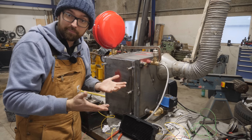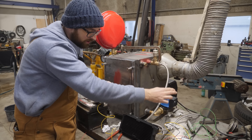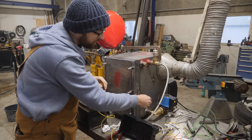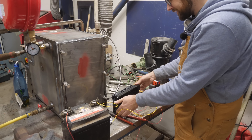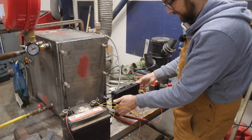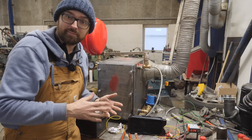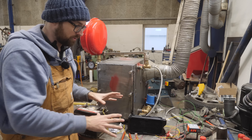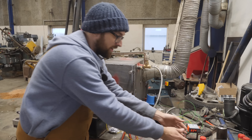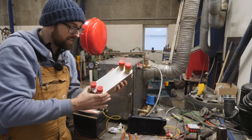The way this system works is pretty simple. There is a circulation pump that pulls hot water from the top of the boiler, where it's warmest, circulates it through a radiator that releases glorious heat, and then pumps the water back into the bottom of the boiler for reheating. The radiator is the type you typically see for water-cooling a PC, with a couple of 12-volt fans strapped to the back — pretty quiet, but putting out a decent amount of heat. I'm considering two different alternatives for radiators and hopefully I can show you both in next week's video. In the final setup there are going to be a lot more radiators, and there's also going to be a heat exchanger thrown into the mix so we can have plenty of hot water for the galley and for showering.